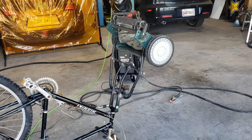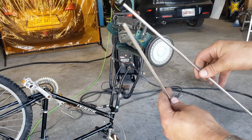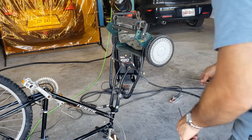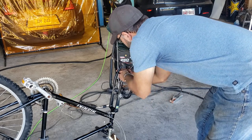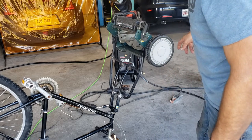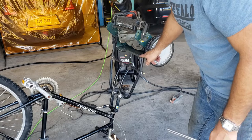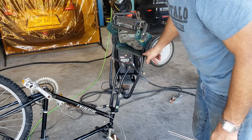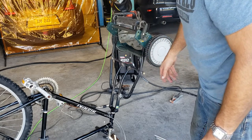All right, so that's welded up and I'm pretty happy with it. Before I flip it over, I've got a couple of pieces of quarter inch stainless round bar, and I'm just gonna add two more little braces just here and then one on the opposite side, just to give a little more support to these short little pieces here. I think all of this is plenty strong, but I'm just concerned about any lateral load on this thin tubing, so a little brace should help.